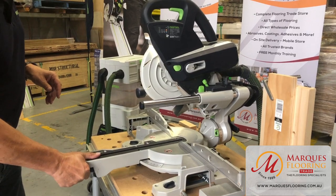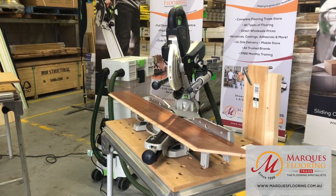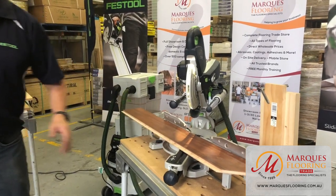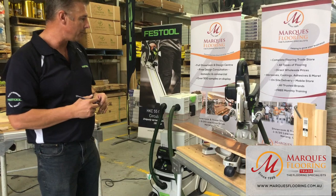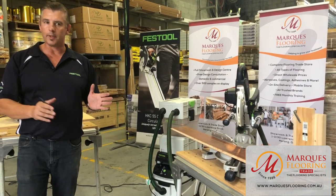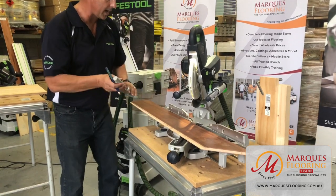To give a quick rundown of the product, let's pop it to 45. The blade that comes with the saw is a 36-tooth blade — a universal blade, but as discussed, depending on your application you may need an additional blade. For timber flooring finishes, especially laminates, you can get a finer tooth or triple chip blade to eliminate splintering and achieve nice clean finishes. You can also flip your board and cut it backwards, or do a scribe cut — though that means cutting twice, which may be worthwhile for an open seam join. The clamp system lets you clamp through the front or back of the saw depending on the substrate width.